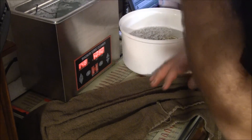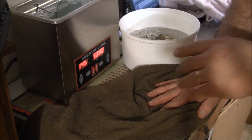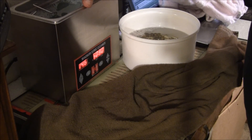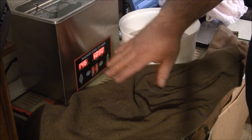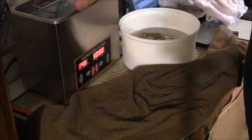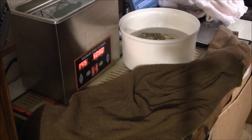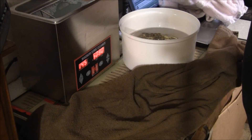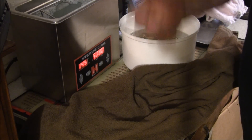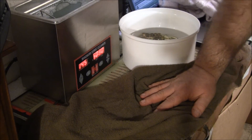I'm going to give you another little tip. A lot of people who use a sonic cleaner will clean brass and then the cleaning solution gets very dirty-looking. If you unplug it, shut it off, and let it sit for a couple of days, all the dirt and grime will fall to the bottom of the pan. At that point you pour the solution into another container - all except for about the last half inch - and dump that. This is okay to dump down the sewer. Rinse it out, then put the remaining clean solution back in. You don't have to change it out after just a couple of baskets.